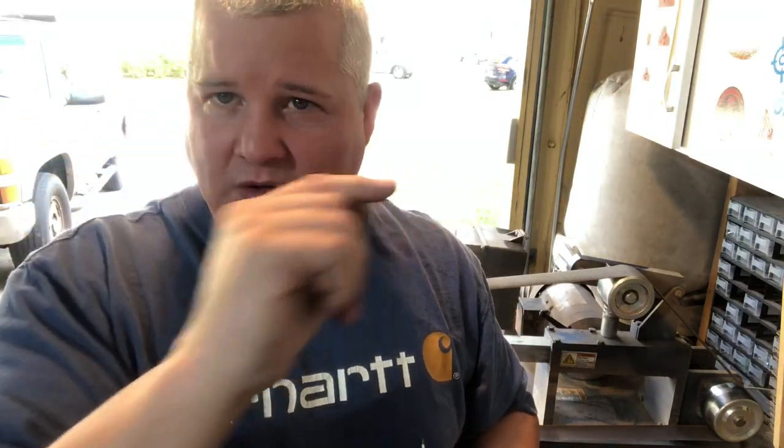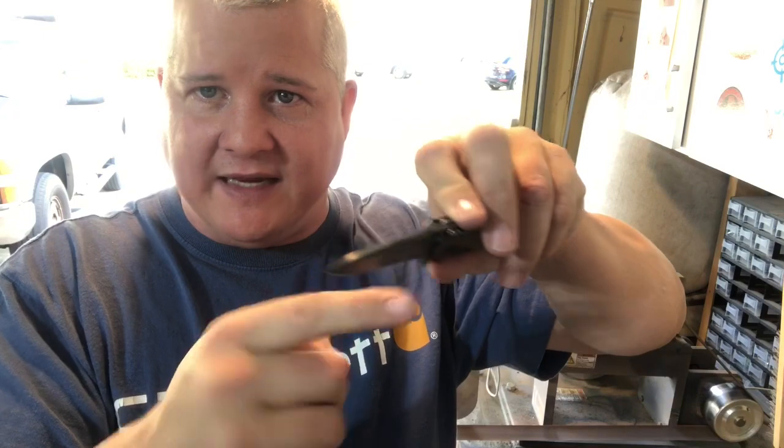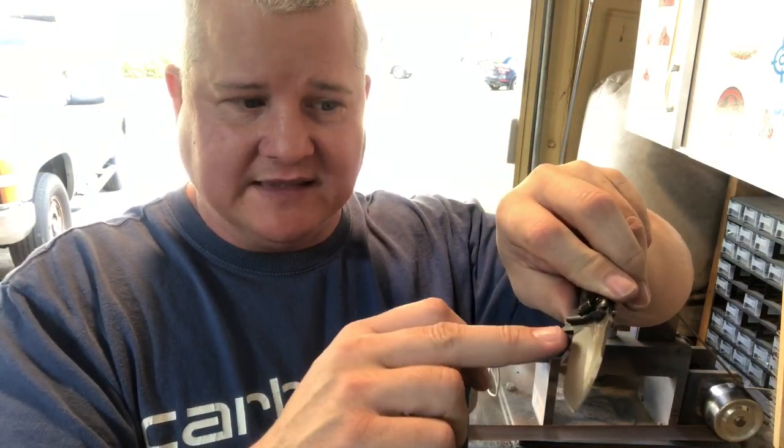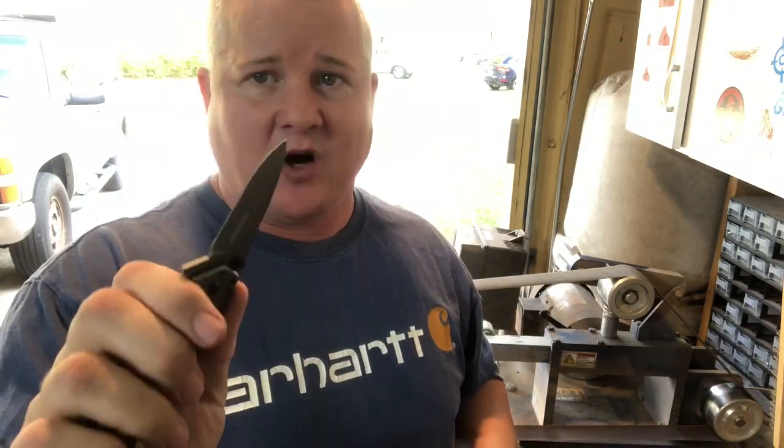And we are going to keep sharpening that burr until it looks like foil. And you'll see little flakes of foil come off. And when you run this across the edge, what you're going to see is that little shiny hairline of a burr, you'll see that disappear as it runs across the belt. If you can't see the burr disappear, you're not getting rid of the burr. You're just flopping it back and forth. And that's why when you sharpen your knife, it's sharp as can be and it won't hold the edge. It's not that it won't hold the edge, you never really got to an edge. You got to a wire edge that's flopping around. And when it's straight, it's sharp, and when it's bent over, it's dull. Got to get rid of that.